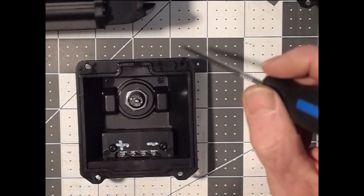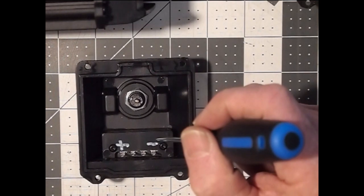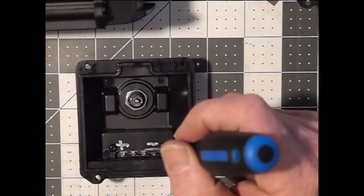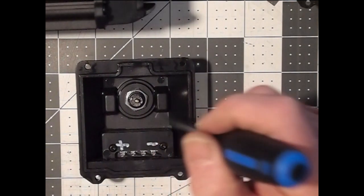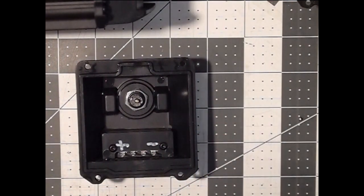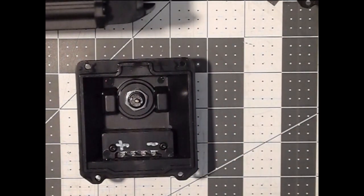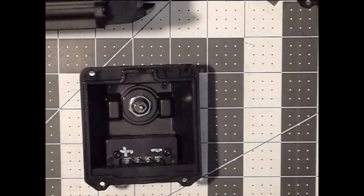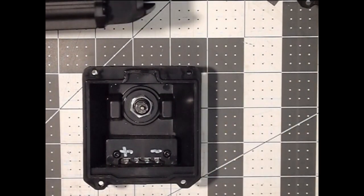A is connected to the positive side, B is connected to the negative. And the reason for that is when you plug the charger into the frame on your bike, these are what is bringing in your charge current, and then they take it over to those. At least that's what I'm assuming. And Frey did tell me that that's the way that is wired in the battery pack. And my other external pack, where I built a battery eliminator out of one of these empty boxes so I could have an external battery attached, that's the way it works.